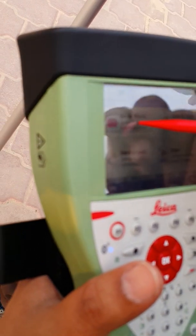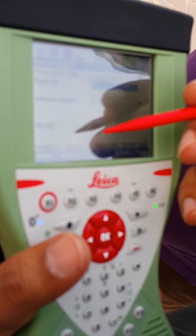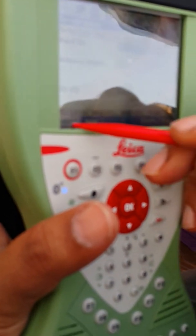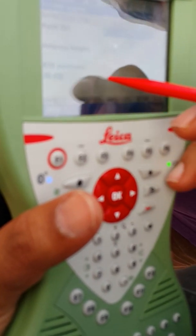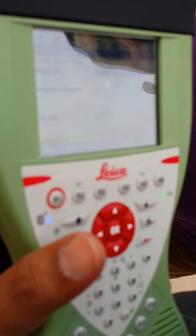To summarize the survey workflow: go to Go to Work > Survey, give a point ID, click Measure, take three or four positions, click Stop, then click Store. On the map page you can see your reference station and the point you measured — that is your position.